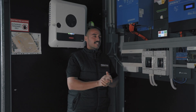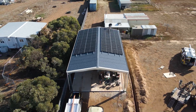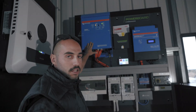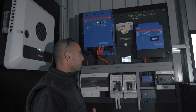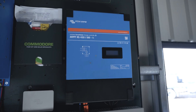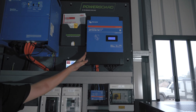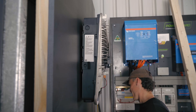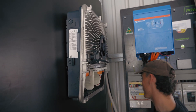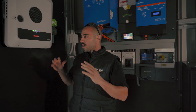Once again, this is a good setup from our friends at Commodore. They've done us a pre-built board for our customer out in Dublin. We've got a Quattro 10 — a 10kVA inverter charger, really good unit from Victron. We were able to couple this up with an MPPT, one of the 450-100s, so we've got DC coupled charging coming straight in from the roof. We've also integrated a Fronius Primo for some AC coupled charging, so we can take some load off the Quattro when we've got high loads.